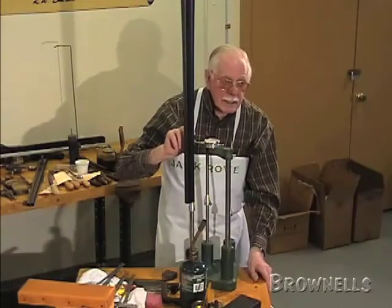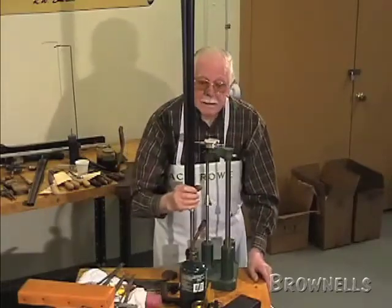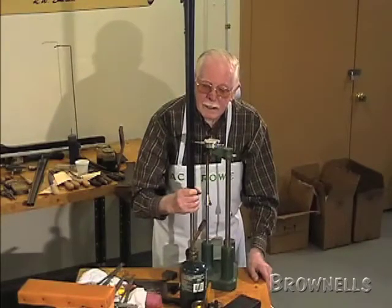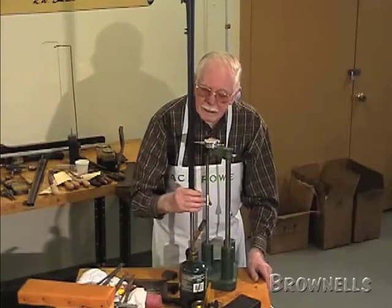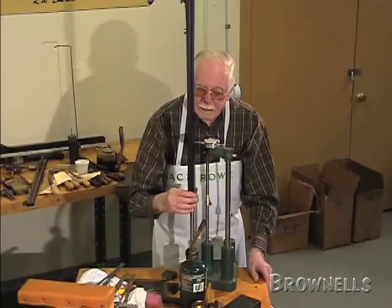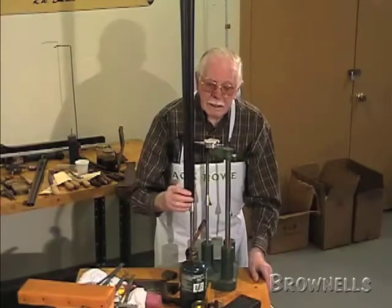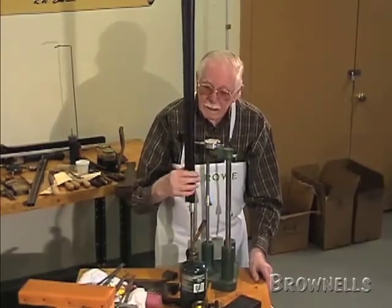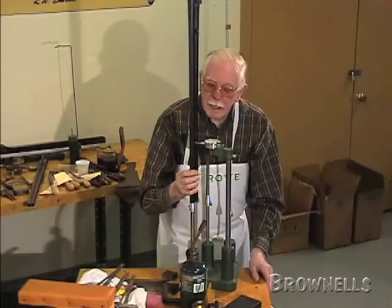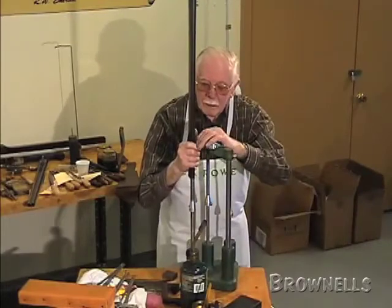This is the place to measure them. If they're very thin there, then the whole lot's too thin. This is varying — it's gone up to twenty, twenty-three. We take it right around the barrel. It's thick around by the rim — it's twenty-eight. Take it slowly around and it drops down to fifteen right in the middle. Then it goes up again to about twenty-eight. You measure both barrels.